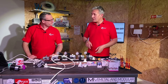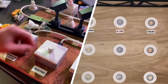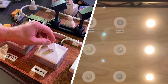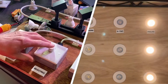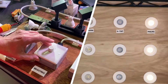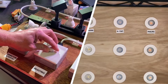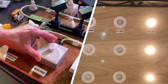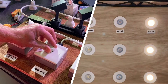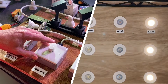Let's have a look at the Selectric one — back to the twist-and-flash method. Paired with the Philips lamps. Again checking the low end level — not quite low enough, so we need to reprogram it. On this one it's a case of turning it to full, turning it back to minimum, off and on twice — the lamp gives you a little indication that it's in programming mode. Then set the low end you want, wait three seconds, and it flashes to say that's been stored.